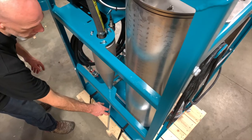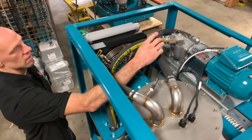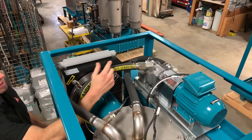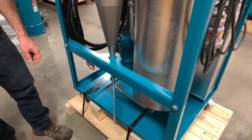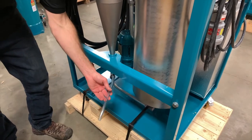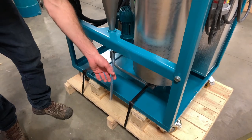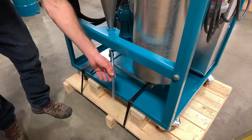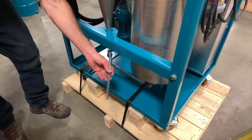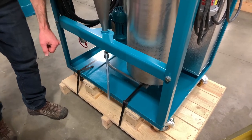The cyclone allows the water to drop out, where it can then be discharged, and that air then comes out the top of the cyclone back into our air pump, where it's reused again through the circuit. One of the key attributes of the desorber process is it allows you to see the water that you've collected out of your oil system. By placing a pail underneath this water discharge, you can quantify exactly how much water you're removing from your system. That sets the desorber apart from many other products on the market.